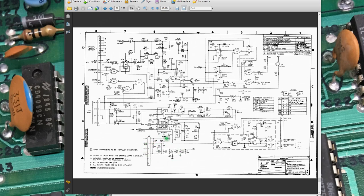There are tantalum capacitors in the system. I had two tantalum capacitors on each of the drives — same manufacturer, same capacitance — that had failed. One of them was nearly a dead short and the other had a low resistance. I had to pull those caps out, and right now I just have electrolytics substituted in. I'll need to order some tantalums to actually replace them, since they were axial tantalums, which makes them rather expensive, and I didn't have any axial electrolytics to swap in.